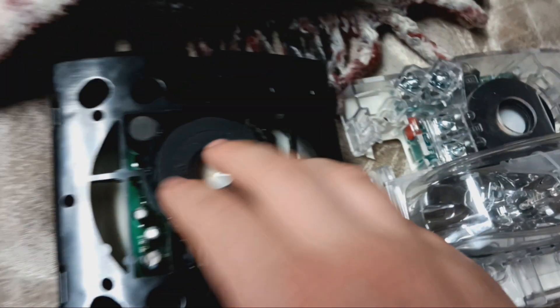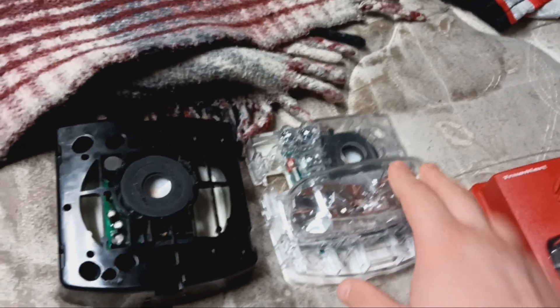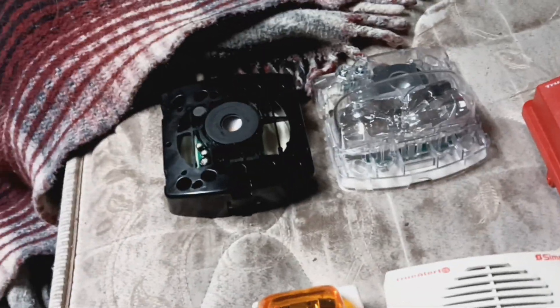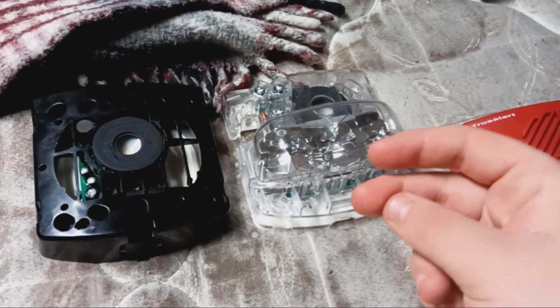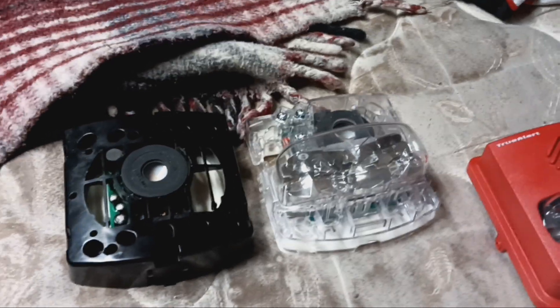The strobe and the horn on this thing — you can see there is a single dip switch. Basically that turns the strobe, only the strobe on this, and the horn of this remote horn, into a syncable device. So when you flick it down, it makes it syncable. How the sync works, particularly for strobes, is that it charges up the strobe and it won't flash until power has come from it — and then it flashes.